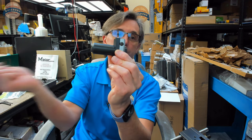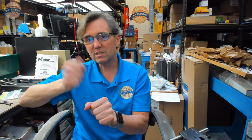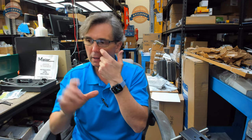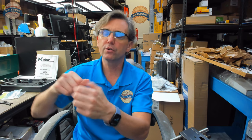Mark for the faceplate. Use a sharp box cutter. So now you've got some scored lines in the edge of your door. They actually show a utility blade scoring that. I wouldn't use that tool at all. A hammer and chisel, light tapping on that works. 1-inch wide, 1.25 inches wide, 2.25 inches tall. Get in there, and all you're trying to do is just deepen that.